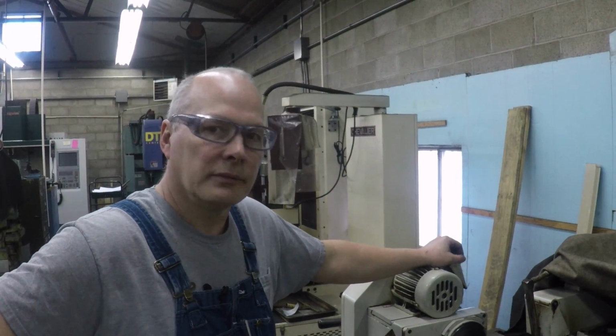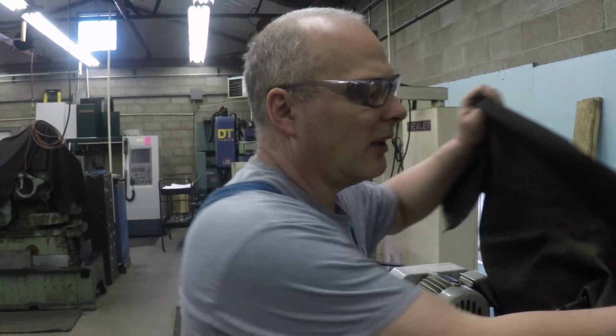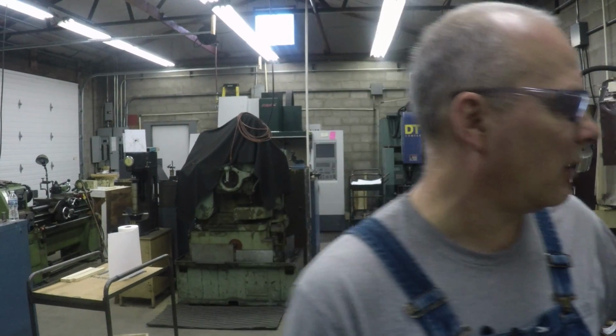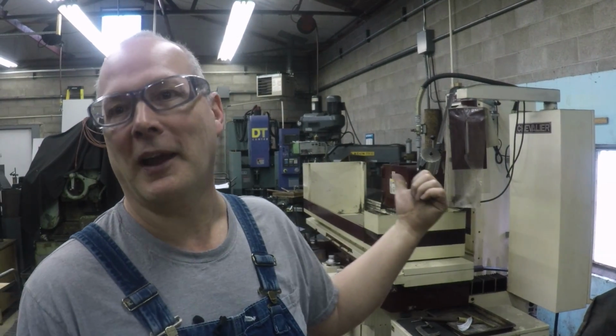Oh yeah. That's awesome. And not only that, but the big thing for OD grinding is not only holding size, but getting like a 10 finish on there or something. That's an RA finish. Yeah. I wish I got to learn more about those. So you have this a real particular machine. The one reason we bought this is to grind cranks. For your models. That's right. Very cool. You make the crank. Yeah, I can make the crank, put it in there, cycle start, and go over here and run something else. Yeah, sure.